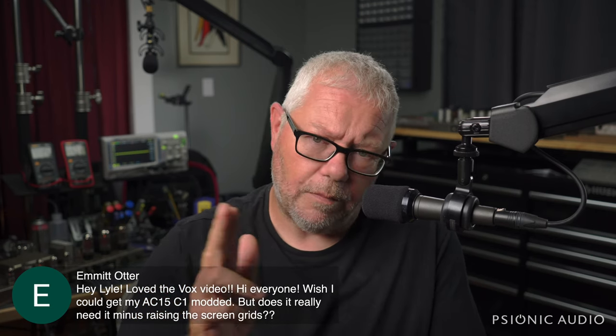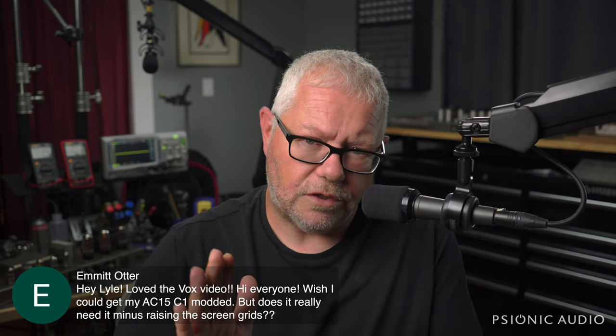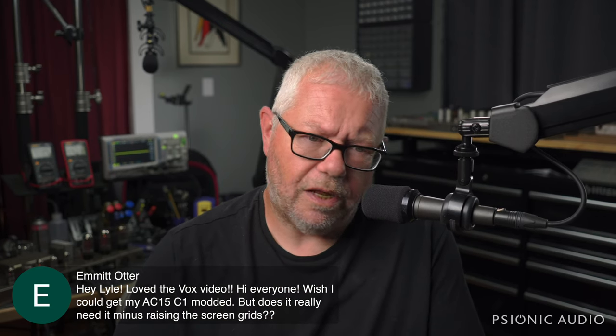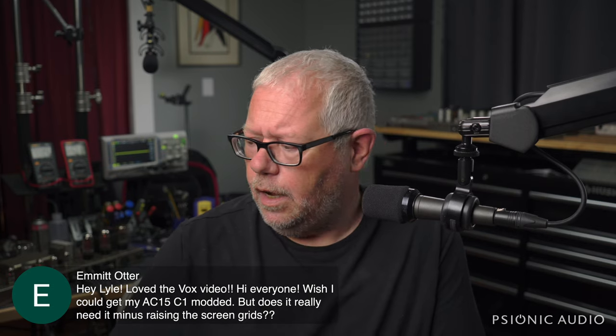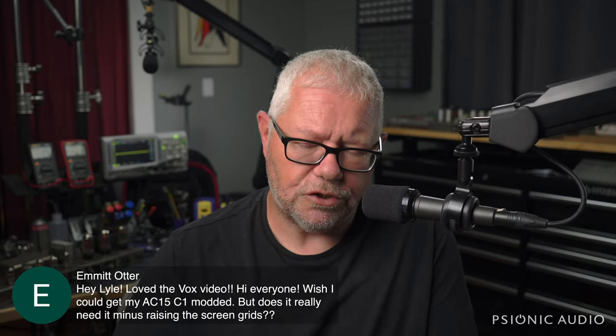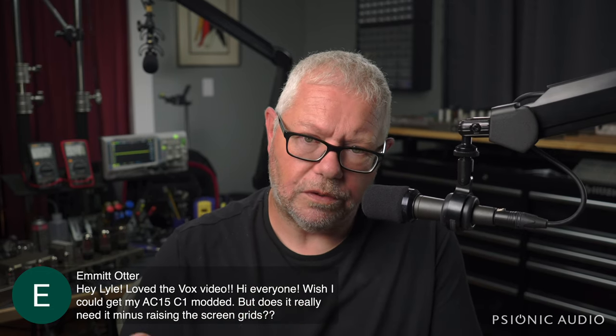I also added a mid switch on the Top Boost channel, which really transforms that channel. You've heard that in other videos, but that was not a fair comparison to the other two, which did not have the ability to do that. Then the rest of it is longevity upgrades on the output section to make sure that there's not going to be heat damage on that board and that the EL84s will last longer.